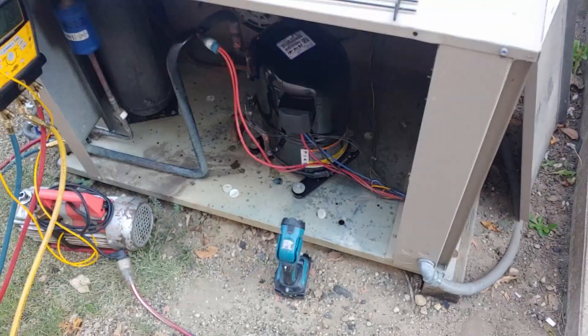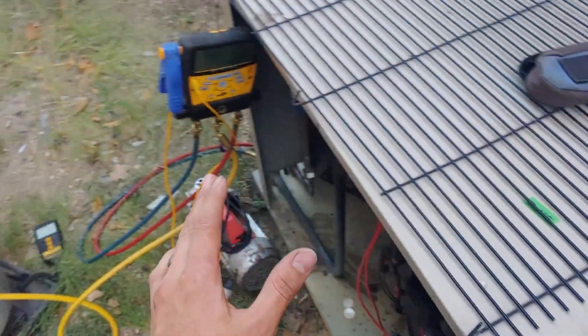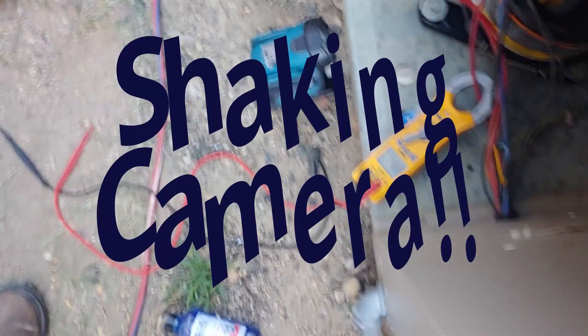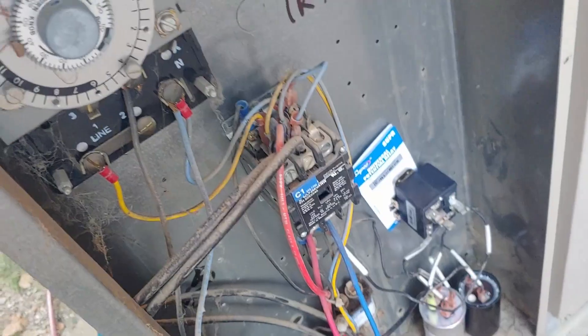This is inside the cooler — you can see this unit runs two evaporators, and really this is mostly just a beer cooler. Okay, so here's the moment of truth: we're gonna go ahead and restore power to this thing. Stopped adding refrigerant — it's just sitting stable in the system. 40.7 amps. Beautiful.